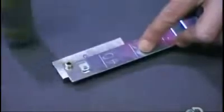A washer goes into each steel spring. They turn it up or down to adjust the spring's tension. That's how they'll calibrate the scale later. The top part of each spring will bolt to the frame, and the bottom part to this slider, a long metal component with weight markings.